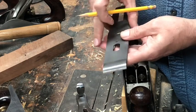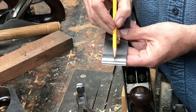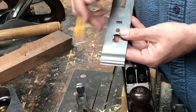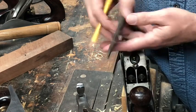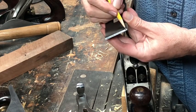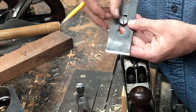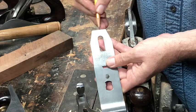Let me show you that — it's a two-part piece. This part here is the chip breaker and this is the iron or blade. The blade has this keyhole shape on it so you can loosen this, pull it back, turn it and separate the two easily. The chip breaker comes off like this and has this round end. There's not a lot of blade exposed — there shouldn't be; just enough to cut. This piece with its curve sends the curl out of the plane and upward and away from the mouth.